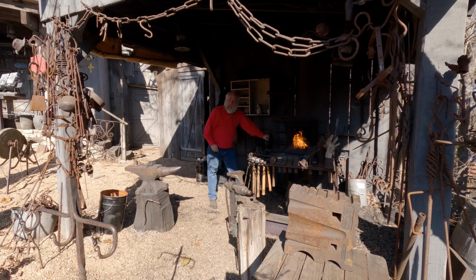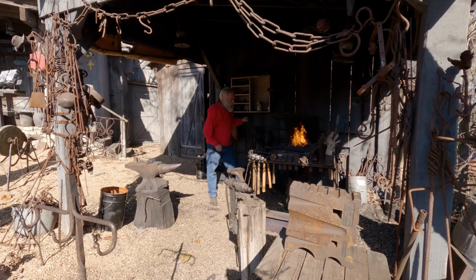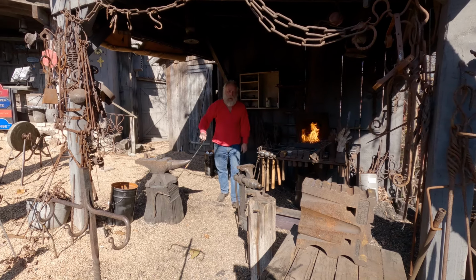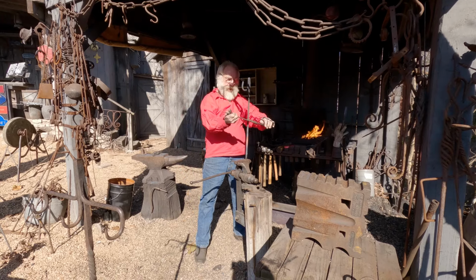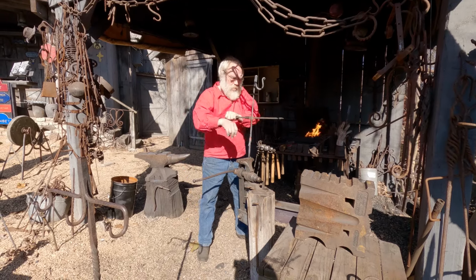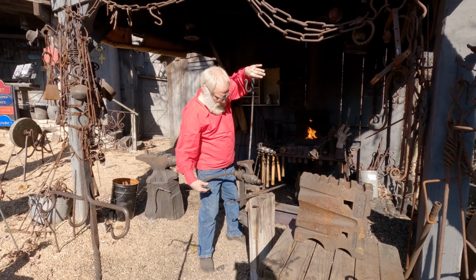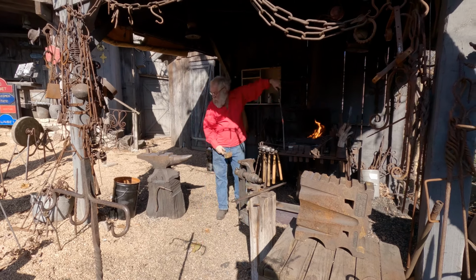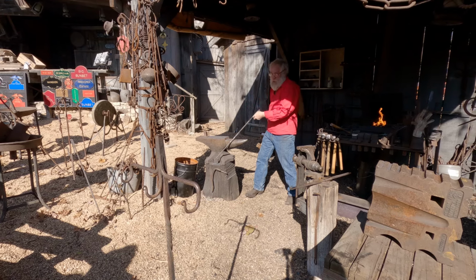A little bit more and it'll be ready to twist. We'll call that good. So I clamp below to twist. Twist above it. I'll go one full turn. Straighten it with my wooden mallet. And I use the wood so I don't tear up the twist. It just needs a little gentle persuasion.